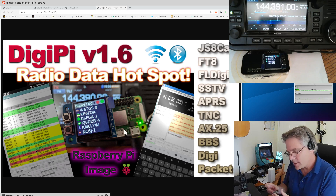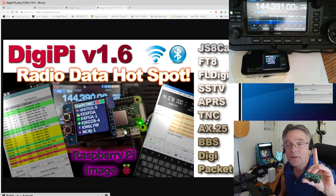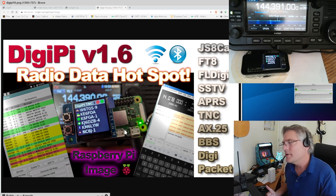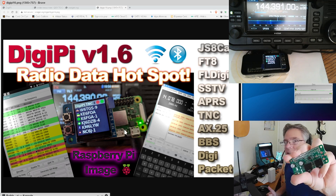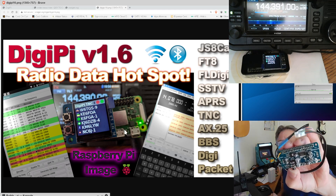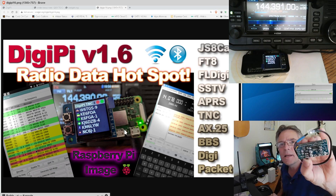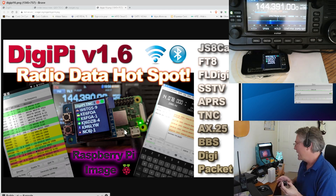You need an audio board with line in and line out. I recommend the FEPi audio card — about twenty dollars and it has line in and line out; you put it on top of your Pi. There's also the Audio Injector Zero, which is basically the same thing — line in, line out — and it's a hat for the Raspberry Pi Zero. You'll find the Audio Injector Zero more readily on Amazon.